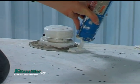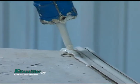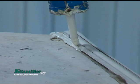Give it ample dry time. You want to try and do this during the day when it's not too hot, not too cold, and make sure the humidity isn't too high — 2 o'clock in the afternoon in Michigan is a pretty good time. Let it lay down, then come back up and double-check it to make sure it's tacked over before it rains. You want to give yourself maybe a six or eight hour window before the next rain for it to get tacky and actually seal everything out. It actually never really hardens, so be careful when you put your fingers in it because it's going to still feel goopy — but as long as it's not shiny and wet, you're ready for rain.